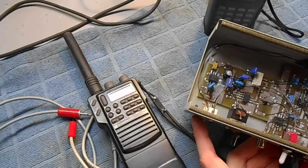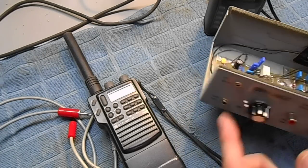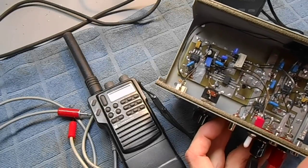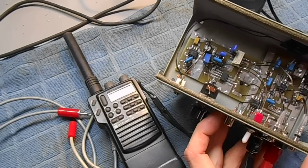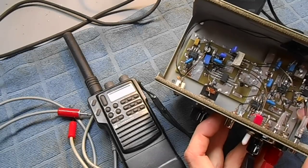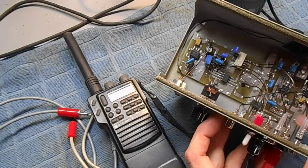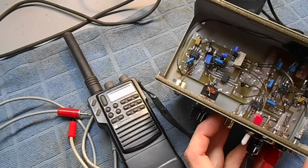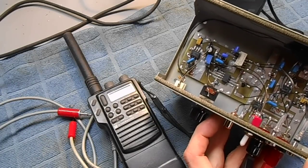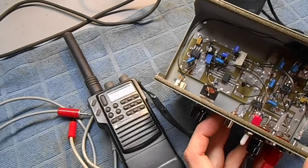It works by tapping the speaker output through a standard 1/8-inch jack and running into an op amp with a slight gain. The output of the op amp goes through two back-to-back diodes where the audio signal is clipped, then amplified again by another op amp very slightly and goes through two more back-to-back diodes.